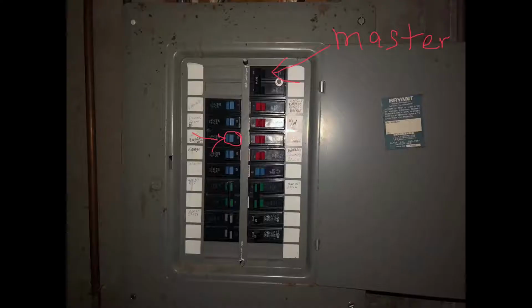Or if you do not have this and you have a lamp, as an example, you could plug in the lamp with it on, and leave the room, and go flip off the switches and figure out which one goes to that outlet. Then you can work safely. If the light bulb turns off in the lamp whenever you flip that switch, that does mean it lost power. Remember, safety first. And like I said, you can turn off power to the whole house with the master switch, or you can find the individual switch, but your whole house loses power if you do the main master switch.